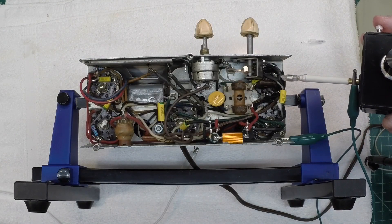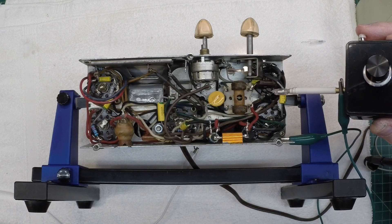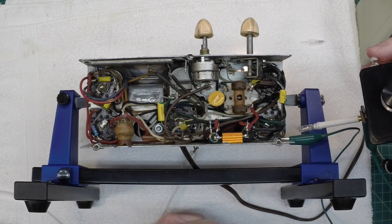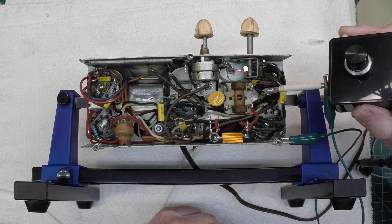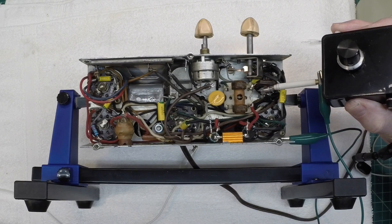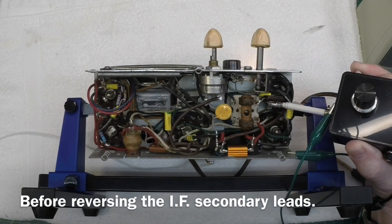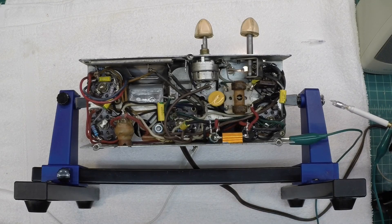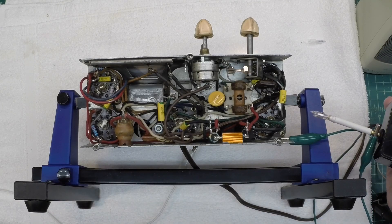You can see it took care of a lot of the oscillation or feedback that was occurring. There are still a few little birdies to work on — that could be my lead dressing or it could tie back to one of the tubes or contacts on the Loctal sockets. But tuned to a station now, you can hear how clear that is compared to what we had before. Reversing the leads on the IF transformer secondary and having everything in phase back over to the IF amplifier seemed to make this particular receiver much more happy.